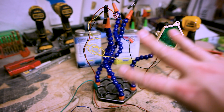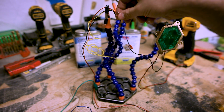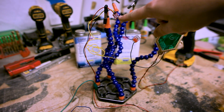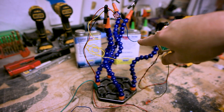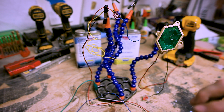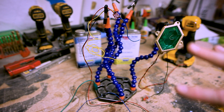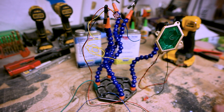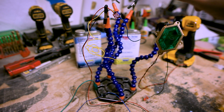I've got this in a strange configuration to show you how this works. Normally with these little red sensors on the back, you have to be within a few millimeters of the word 'touch' on the back of it. But once you solder a little antenna to this pad — I'm going to disconnect it real quick — once you solder a little antenna to it, it increases the read range. I'm going to plug it in here with five volts and it's going to take a little bit of a sensing area to get a baseline reading. And so now with this antenna, I can get closer to it and the read range increases quite a bit.